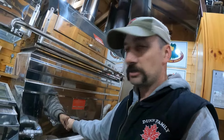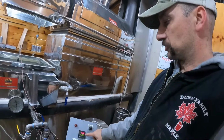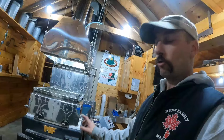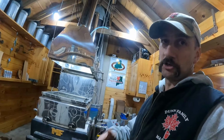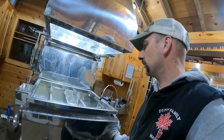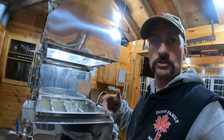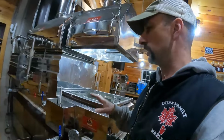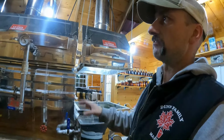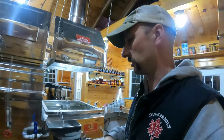I think it's cold permeate, but like the syrup pan, the temperature is still climbing because of the heat in the bricks. Normally I leave that door open just to try and get the heat out. Tonight I kind of want that heat to go into this pan and just work. So the syrup pan I don't think is gonna clean up as much as that flue pan, but I'm just gonna let that flue pan ride and see what it does.